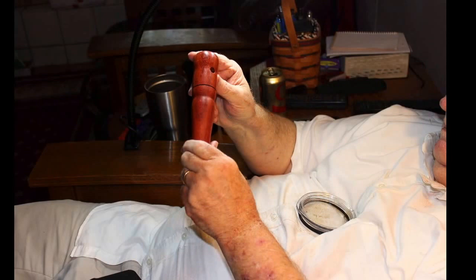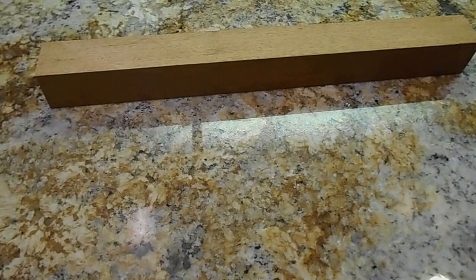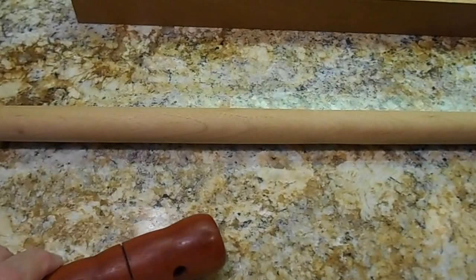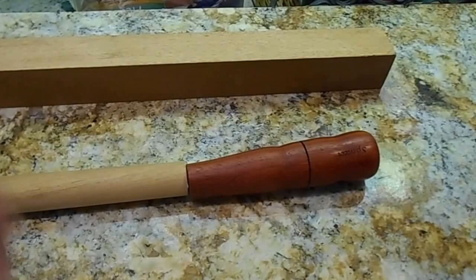This Paduk is beautiful wood. Here's one of the finished toppers — I just picked a shape since it really won't be held in the hand; it's just a topper on the walking stick. Here's a section of that mahogany. I took the sections and turned them into a shaft about an inch and an eighth in diameter. This is really straight grain so it turned very nicely. These are a little longer because they were set for the top height I wanted to achieve, which was about 24 inches. Here's a close-up of the topper — I laser engraved the person's name on it, and it attaches to the top part of the shaft with a dowel.